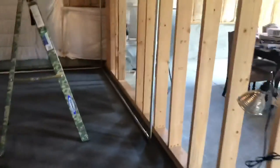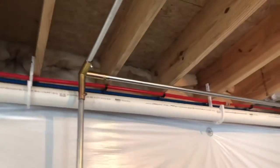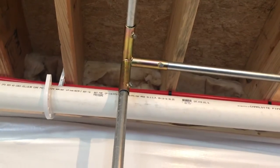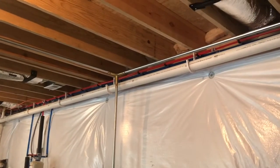I think one of the harder parts is done now — this thing literally fits perfect. I measured everything in a few spots just to make sure I cleared it. As you're doing this, the directions ask you to insert into the corner brackets about four inches, so as I cut them I marked them with a Sharpie at four inches. Once everything was up I was able to go back around and slot it out to that four-inch mark — everything's perfectly square. Next we'll be going around putting the enclosure together.